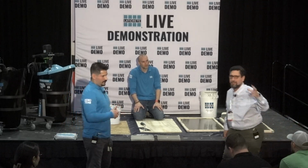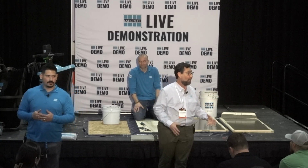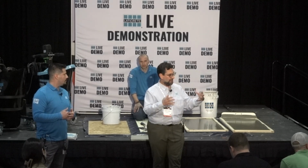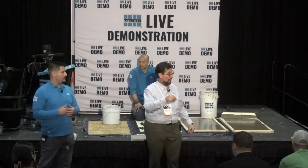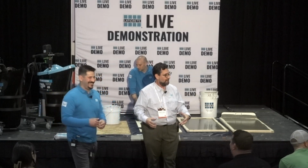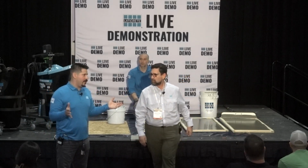The question was, do you have to prime the floor? The answer is yes. Like almost any other self-leveling, you need to prime the floor. The good news is that it's the same primer that we use for our standard levelers and the same criteria, where we use a water drop test to see whether the surface is porous or non-porous. It's the exact same process as if you were using a standard. So we have two options for priming.